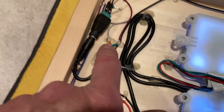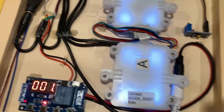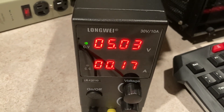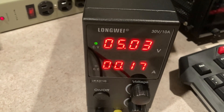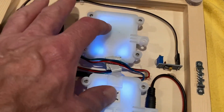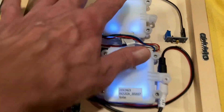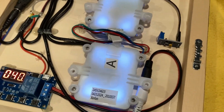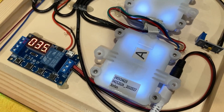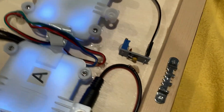I tapped off the five-volt power coming in right here. The total current for everything — the eyes and the flashing LEDs — is about 170 milliamps at five volts. That's why people were complaining about battery packs running down pretty quick. For a smaller battery pack like four C's or four D cells, it would run for a few hours and that would be about it.